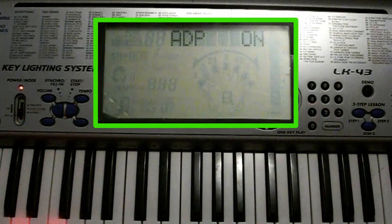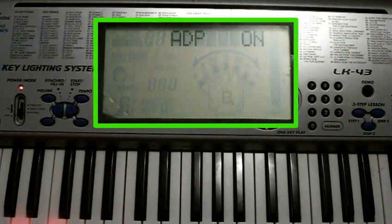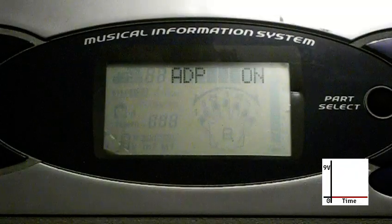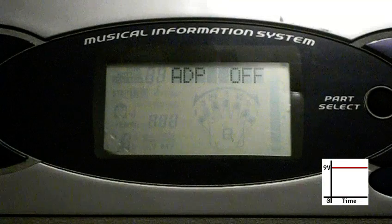When you release both buttons, the screen will tell the status of the AC adapter jack, and key lighting lines LX1, LX3, LY0, and LY2 should activate. Connect a power supply that can send low pulses — the AC adapter status should change. Each test will be cycled by sending a low pulse through the power supply.